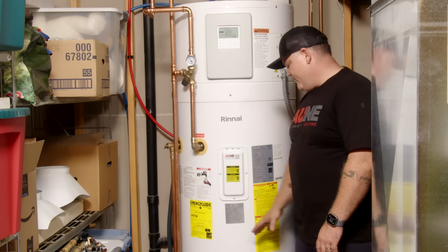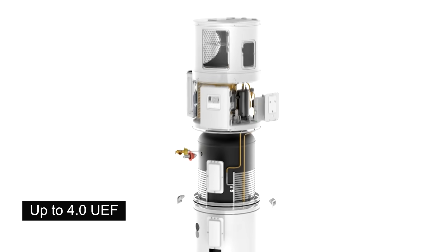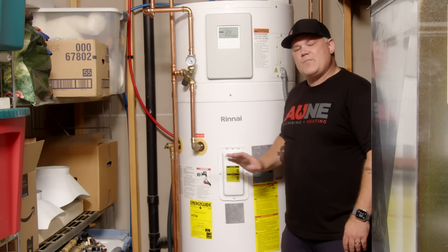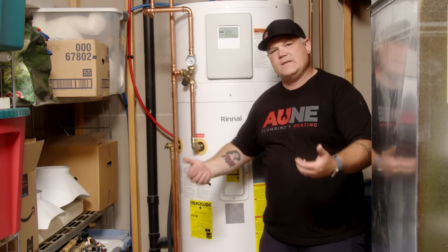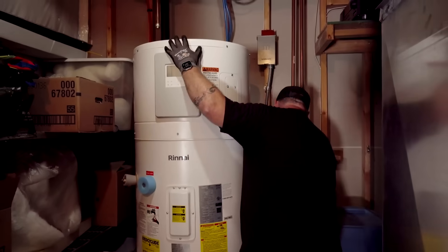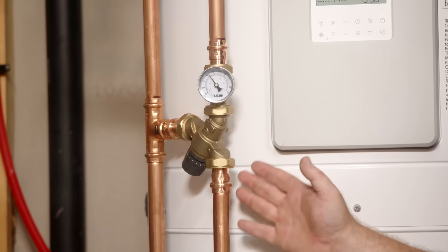Very impressive material selection that they chose for this steel tank. It's got an anode rod, and that's behind this housing here among the heat pump system on the top. Right in the front you've got access covers to standard electric heating elements — 4500 watt elements top and bottom. And then you've got some really cool handles built into the side of the tank. I haven't seen any tanks with handles on them before. It made moving this behemoth around a little bit nicer — those handles actually did help me position it where I wanted.